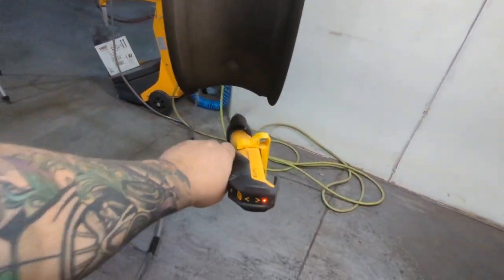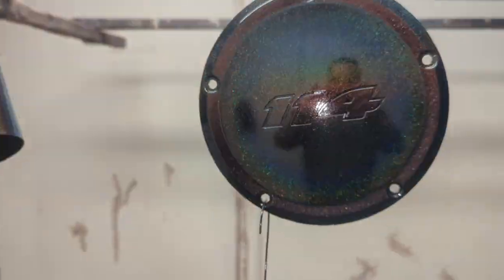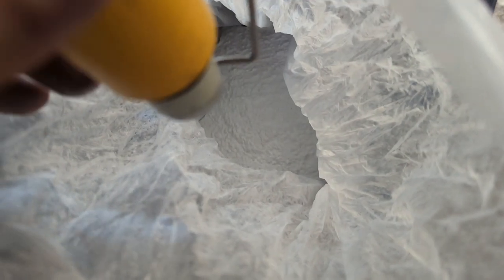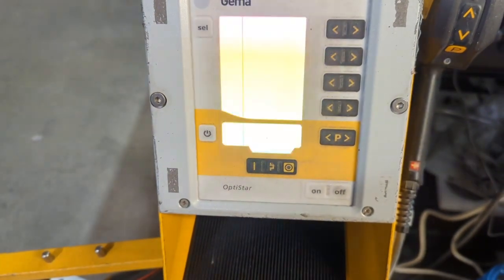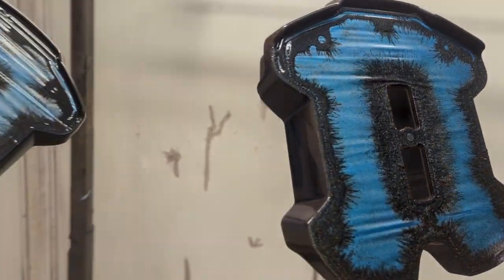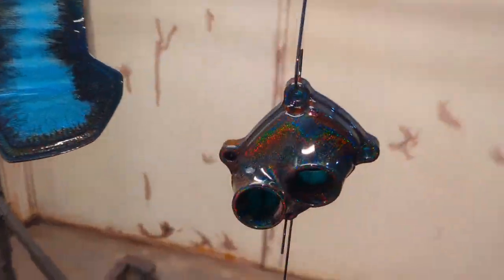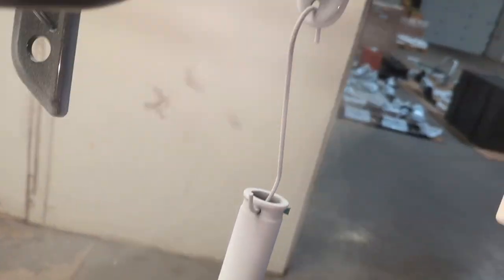You can see I'm using long strokes — I'm not doing that wrist flick thing. It just depends on the part I'm coating or the shape of the part. This is Kachow after curing, and now we're ready for some Clear Vision. Program 2 ready for the second coat. If you know anything about me or have followed this channel for a while, you know I love prismatic flakes — really just any flakes or sparkles of any kind. I get made fun of all the time because I like all this wild stuff, but it's hard to do gloss black and matte black all day. When you get to do cool stuff like this it makes the job way more fun. Now throwing some Clear Vision on everything.